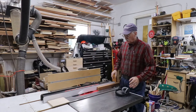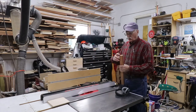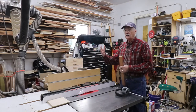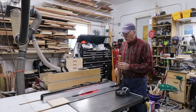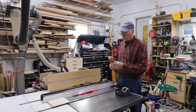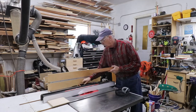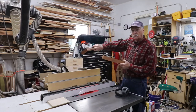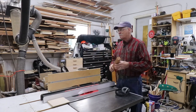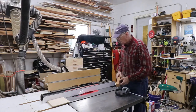The blade is set to 45 degrees — measured twice to get a nice solid 45. I've measured over how far I want to cut so I can make sure I cover that 45 completely and then have to remove as little wood as possible. Some may ask why I'm not just cutting a rectangular piece of wood and gluing it on. I'm trying to match the grain as best I can — this surface here matches the grain best for the back of the box. You're going to see the repair, there's no getting around that, but I want to make it as clean as I possibly can. So let's make a cut.